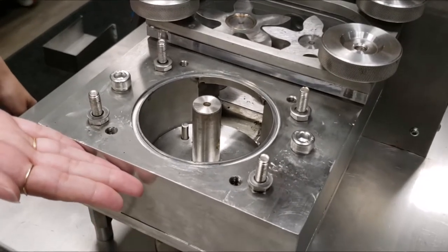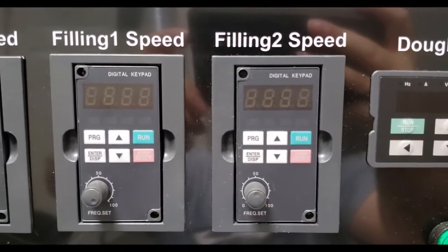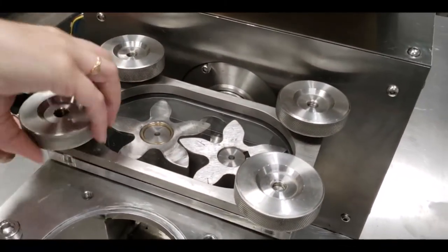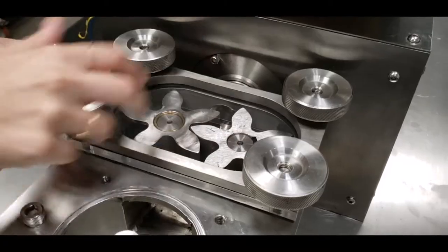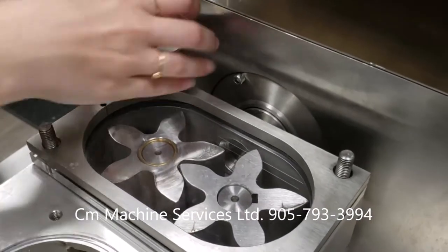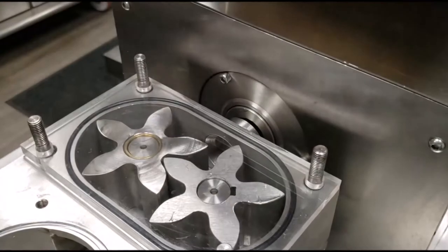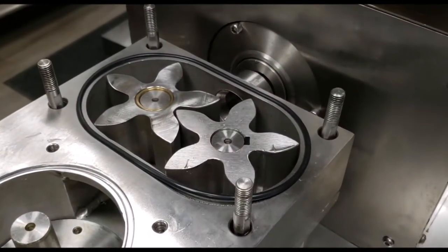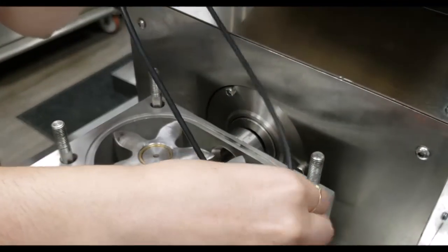This is considered Filler 1 and this is Filler 2. It is controlled by the control panel here, as in Filling Speed 1 and Filling Speed 2. We are now going to remove, for cleaning, the dials of the Filler 2 section. After removing all four dials, you can remove the plate. Under that plate there is a plastic cover that's also sealed by the O-ring. Again, please pay attention to the O-ring — do not lose the O-ring, and it's important to wash the O-ring at the end of the shift.